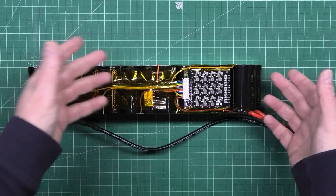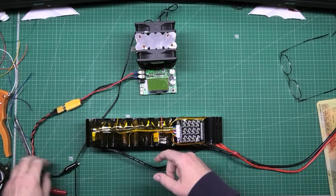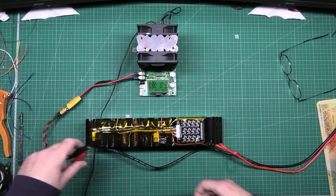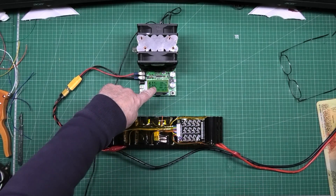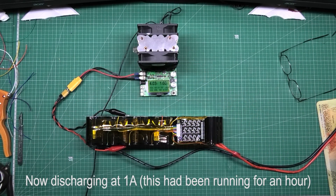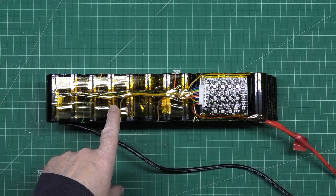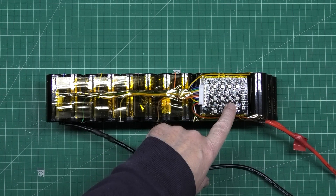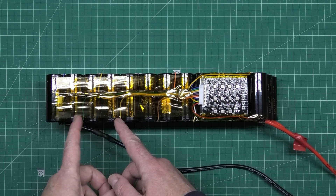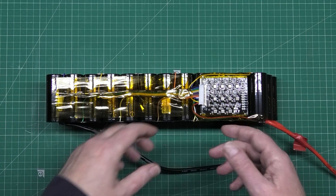Because these cells are actually very well balanced, I'm going to have to discharge one of them to test the balancer. I've got my discharger set up — it reads 4.11 volts. I've discharged the fourth cell and that one a bit, just to make sure, to see what happens. In theory, the balancer should be taking power from the higher cells and slowly transferring it into the lower ones — that's basically what happens, completely balancing the pack.